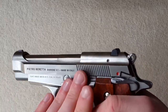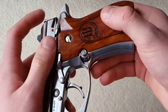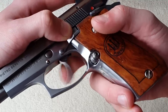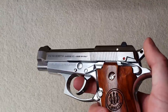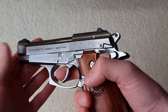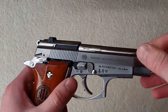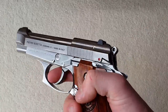I have since repaired this issue, which is why the double action now works. Out of the box, if the hammer was in its forward position, the trigger would pull and nothing would happen. Some people on forums say this is realistic, but that's not true for this type of gun — pulling the trigger should move the hammer. The linkage was just slightly out of tolerance.